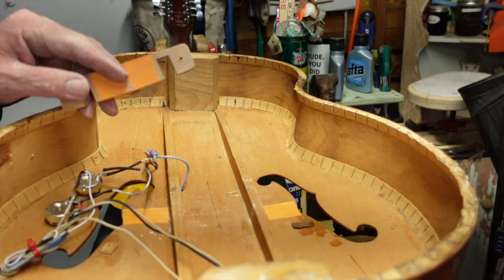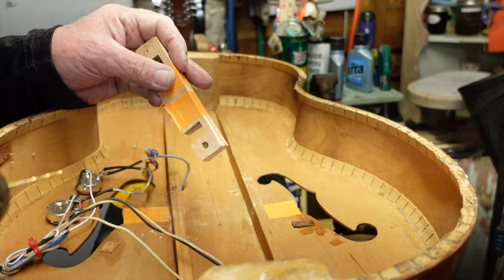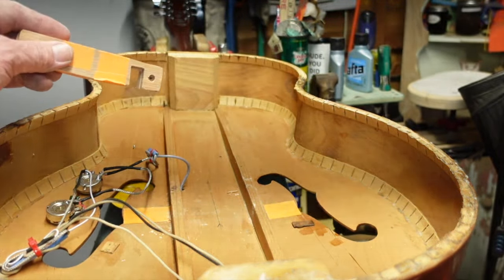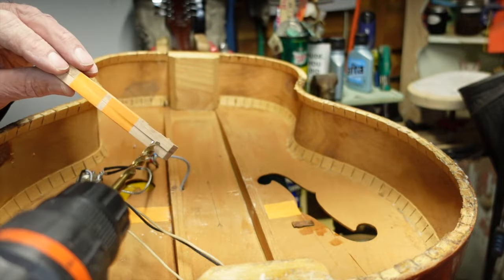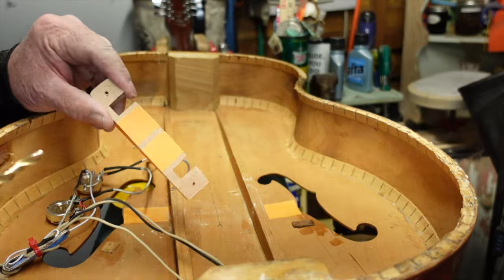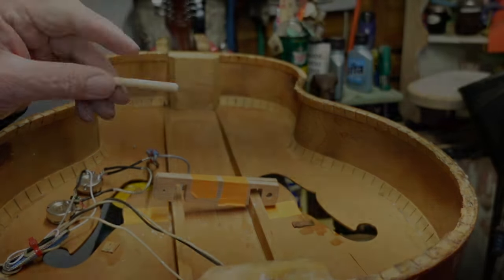Okay, guys, little hint. When you are drilling the holes for the dowels here, you want to use a pilot bit like this. You want to go through both of them, and then take them apart and go through one side first and then the other side on both of them with your bigger bit, because if you don't, you're going to end up with a lot of blowout. This is oak, so I would drill this here, flip this over, and then go to each one and carefully drill. Start off by drilling backwards, because that'll get things going for you, or even use a countersink. But the whole thing here is to get these like so, so we can put the connector pins in.